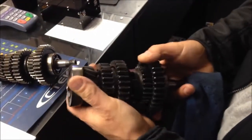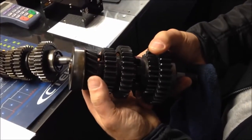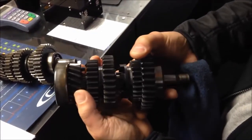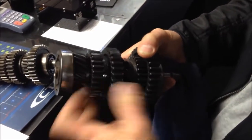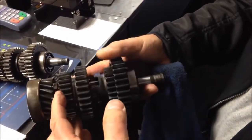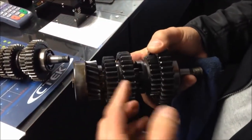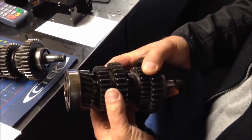And sometimes, because of all that axial thrust, it tears up this bearing too. But the biggest thing is that it damages this. Sometimes it damages the shift fork — the fifth gear shift fork, which rides here — because this is what engages your fifth gear. And because this whole assembly is moving this way as this bearing is being pulled off, sometimes it will damage the fifth gear shift fork also.